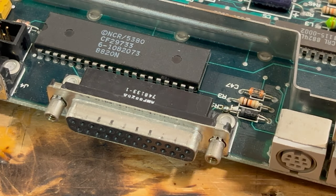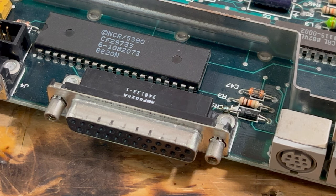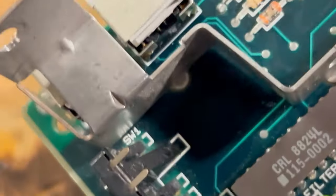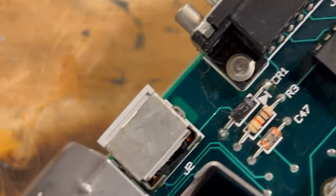There are sides there, so I'm just going to flow it just to make sure. Then we can clean it up, snip the leads off, and it will look good. It's drying — looking pretty good, all nice in there. On the back side it looks just fine. I'm drying the alcohol off the back of the board and cleaning the rest of the flux off. Sorry I'm doing this off camera — just trying to get it all done here.